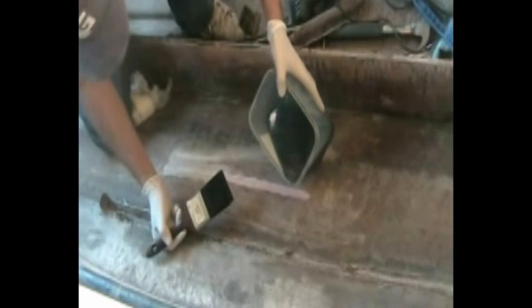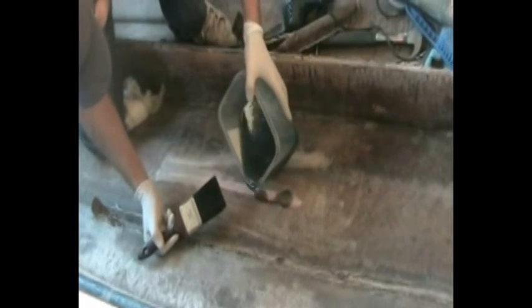You'll notice the matting virtually start to disappear — that's good. I've got all my chopped up stuff that I need: my weave over there at the front and my chopped strand at the back, all separated into what I need to use first, in a reasonably clean area. We're going to remain clean. I'm just going to fill in the crack with some resin straight up, just to try and avoid getting air pockets in there.